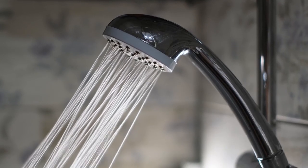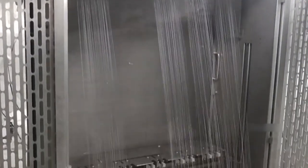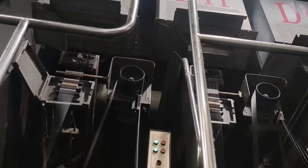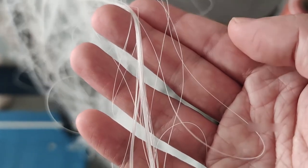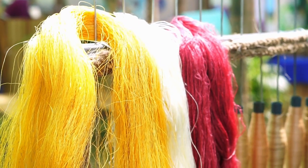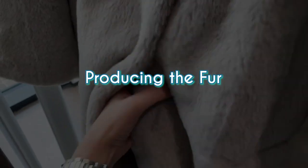The spinnerets are similar to shower heads, and the extruded polymer emerges as a continuous group of fibers called a tow. The tow is then stretched and washed while being dried to remove the acetone, leaving only the polymer. The fibers are then annealed to make them stronger and cut to the appropriate size using a machine. Once the fibers have passed various quality control checks, they are soaked in dye solutions to achieve the desired color. While this is not the only stage where the fibers are colored, it is typically where solid background colors are achieved.